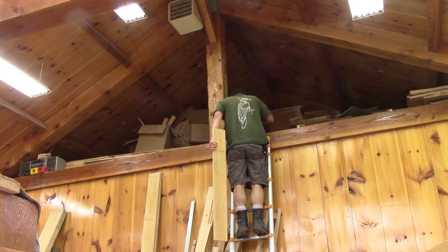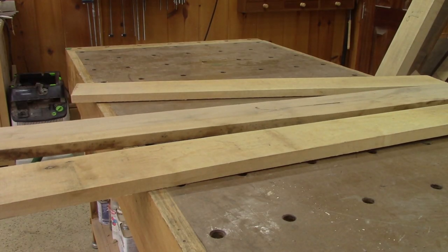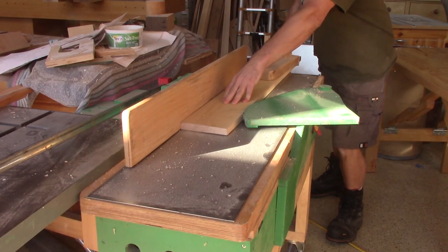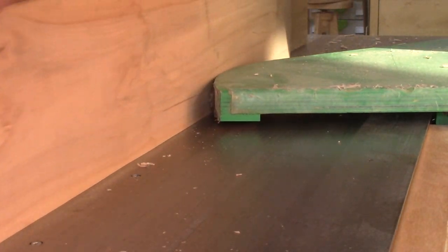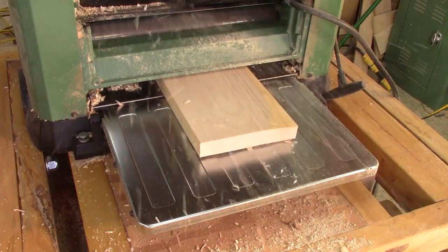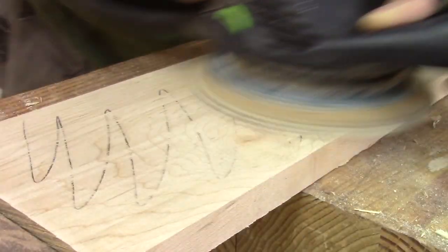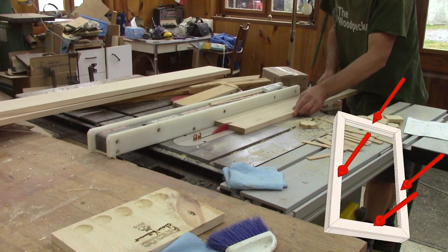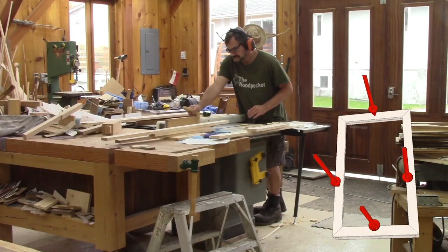To do this, I need wood. I got some maple planks that Stéphane, one of my viewers, gave me last year. Thank you, Stéphane. The first thing to do is to surface all the wood I will need for this case. Next, I sand it up to 120. I rip enough wood to make the door frame and route a nice profile on each side of those planks.